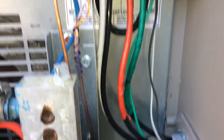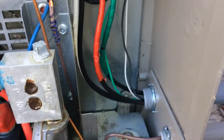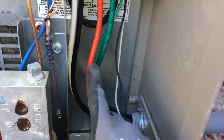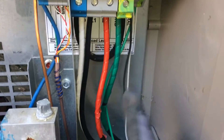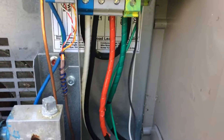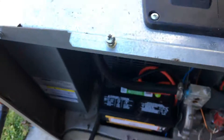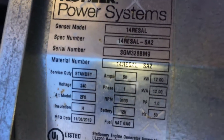Here's the four conductors coming out of the one-inch, plus an extra 120-volt circuit to trickle charge the battery. That's just 120 volts — there's your hot, hot, neutral, ground. We use six gauge, which is supposed to be good for 75 amps, and that's what this unit has — a 70-amp breaker.